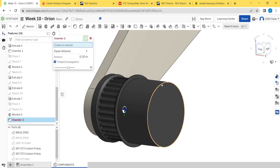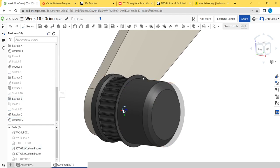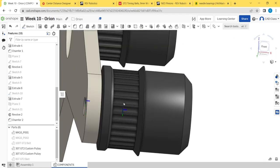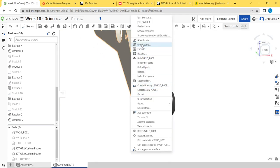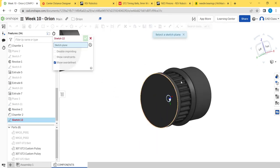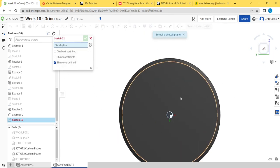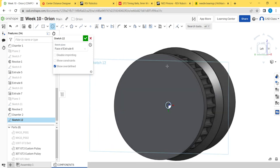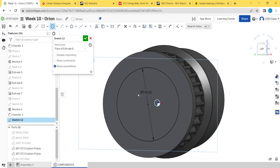We need to actually define the tube size in the sketch and confirm it is 0.625 inches for the five-eighths tube — and the model updates as expected. That confirms our custom pulleys are designed and good to go. We're going to end this parts studio session here and pick up working on the assembly in the next part. See you in the next video.